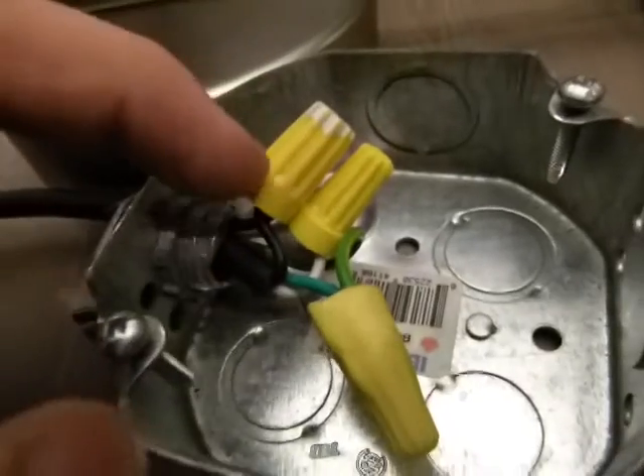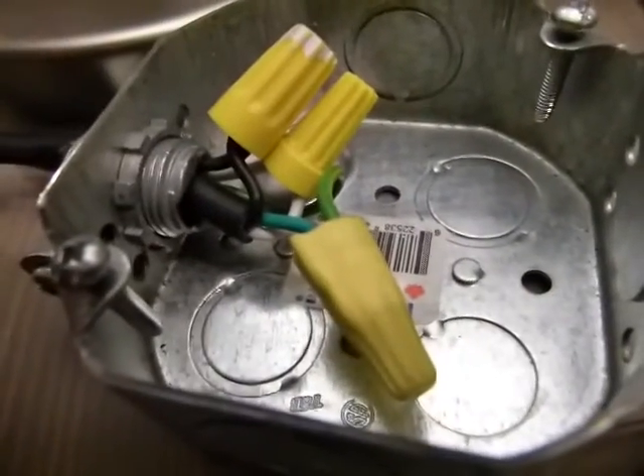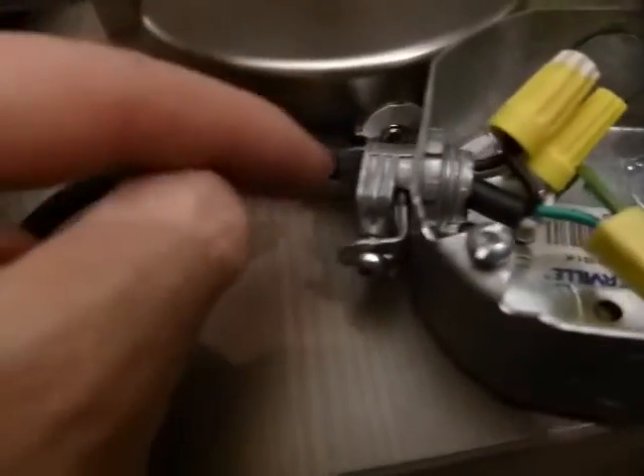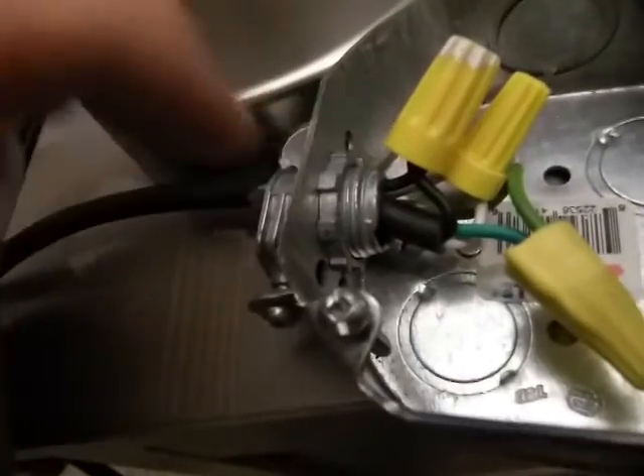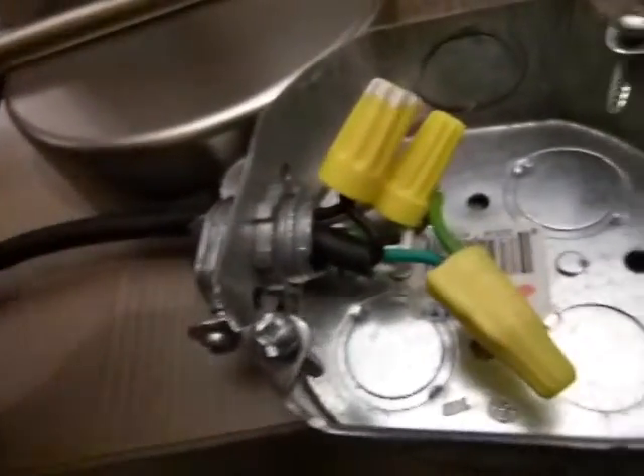Now you know what's inside these little yellow cones — they have a French name too, but don't bother. You can also see I added one more feature that stops the whole cord from placing a load on the electrical connections. This is a little metal clamp. A screw forces a push plate, and the clamp is held in place by that retaining ring there — that needs to be placed in it. That's important. Then put this cover plate on and it's good to go.